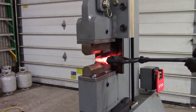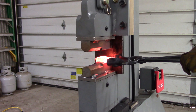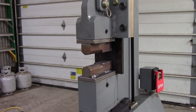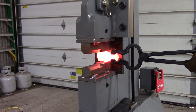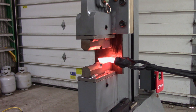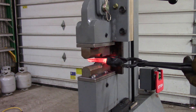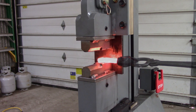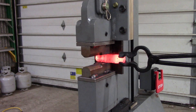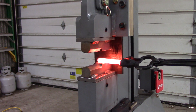This is the little piece I cut off the end — about an inch and a half long. I went ahead and ground away some of the mess on it, ground into some of those grooves, and ground out the parts that were unwelded. I'm just going to try and squish it out and see about how much I can get out of it — that's going to be about an inch and a quarter wide and down to about three-sixteenths or a quarter inch on the press.